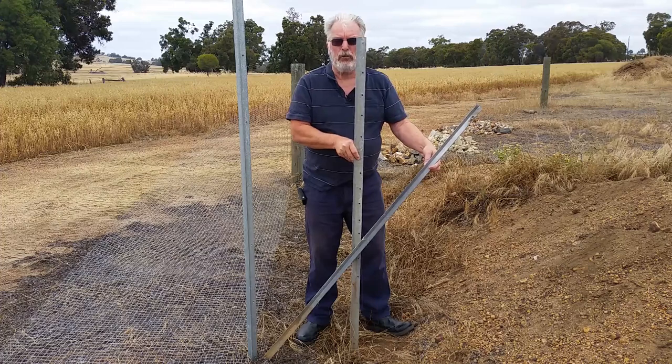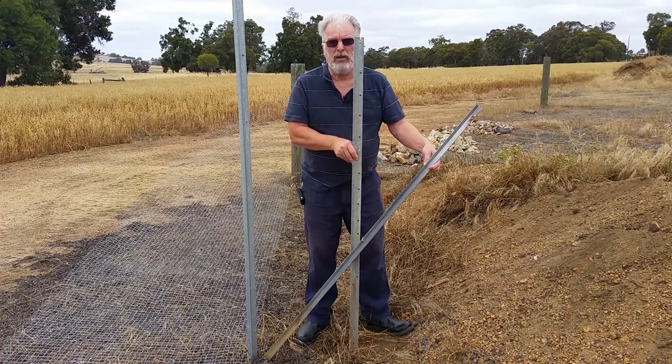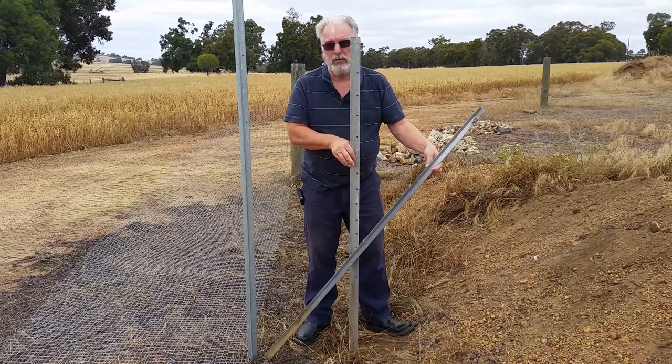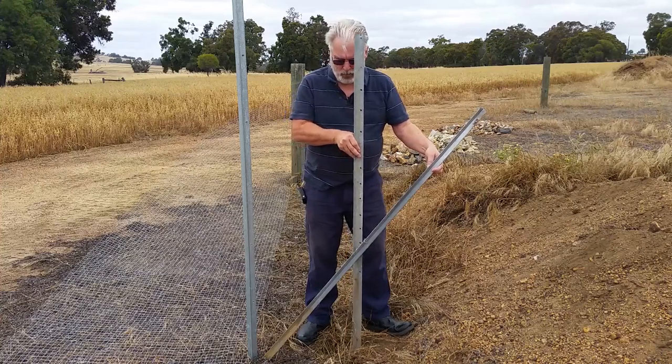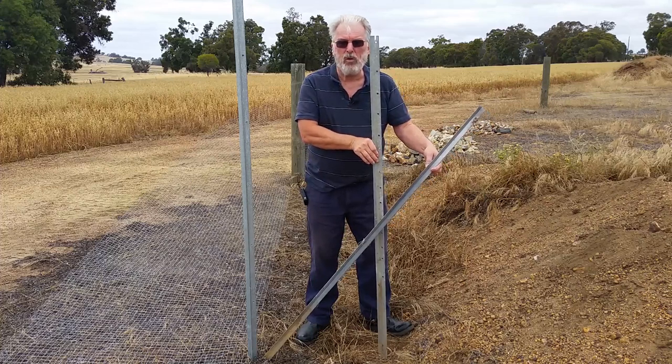Engineers have decided that for a gabion wall, or for any other retaining wall in that matter, half of the height is the width of the toe of the wall. If you have a reinforced concrete wall, it can be a thin wall with a toe, and the dead weight of the sand on top supports the rest of the sand behind it. So that's the basics of it. Now for a gabion wall, probably 2 foot would be what we require.